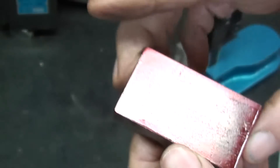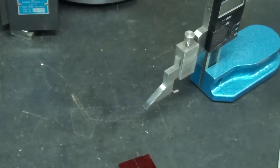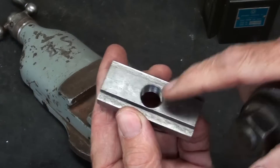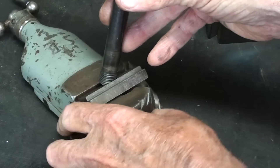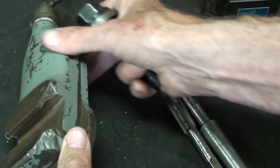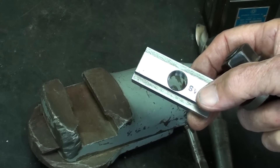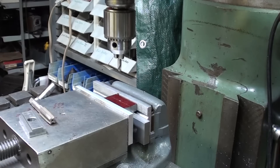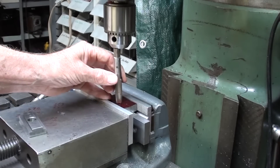The first thing I'm going to do is drill and tap that hole. There is the center — I will center punch this and we're ready to drill. The thread is going to be 9/16-18 and the tap drill size is 33/64. The reason I'm making such a big deal out of this hole is it has to be absolutely perpendicular to the workpiece, or after you have it mounted in there it's going to draw it up at an angle and either will not tighten down properly, or you're going to crank it so tightly that you're going to damage your compound and break it out. So be careful of that — that's why I'm doing this on the mill. Here I am at the Bridgeport. You can drill this on your drill press, but the critical thing again is tapping it straight, so it could be drilled and then the tap guided to be perfectly perpendicular.